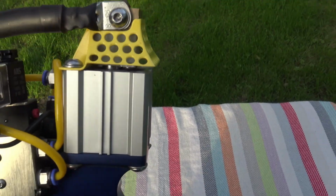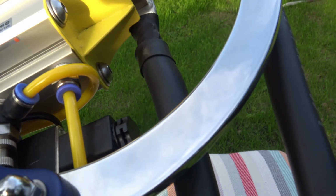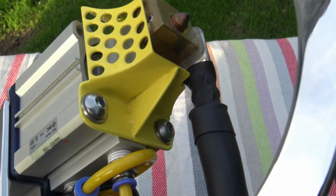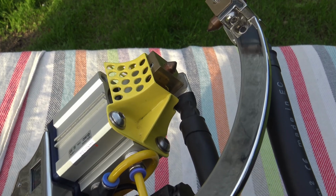And so this pneumatic cylinder is specifically designed around the clamping force. The stroke is selected to be, I think it's 40 or 50, it says there. Sorry, it's 50 bore, 30 stroke. So the 50 bore is to do with how much force it gives out. There's also a control valve there for regulating the pressure. This guard is specifically handcrafted too. One day I took to build the guard and satin powder coat.